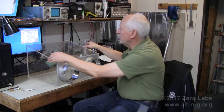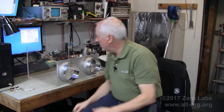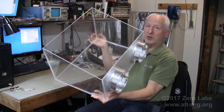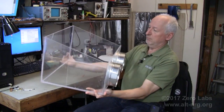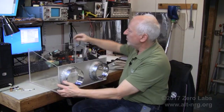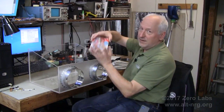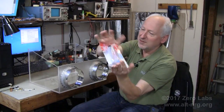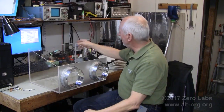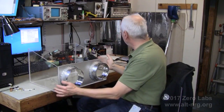As I said, all that's really left now is to glue the top on. As you can see, the rest of the box holds itself together pretty well. All I've done is temporarily taped the seams around the edges and then run my bead of Goop adhesive — the famous Goop adhesive, my go-to adhesive. It's a very elasticized, rubberized type of adhesive to seal the corners. It's kind of like an aquarium tank.